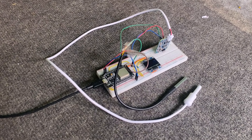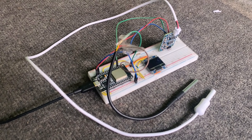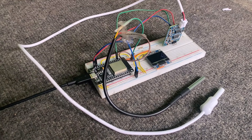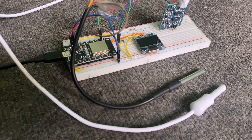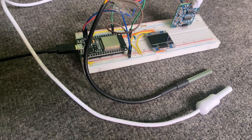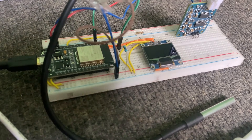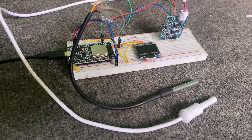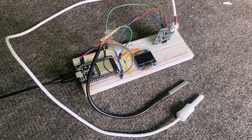As you can see here, the ESP32 module, OLED display, temperature sensor, and TDS sensor are all connected to the ESP32 with the help of jumper wires. In case you want to use a custom PCB for this project, you can use a PCB designed using EasyEDA. The Gerber file for the PCB is available in the website article.